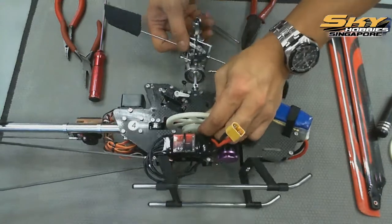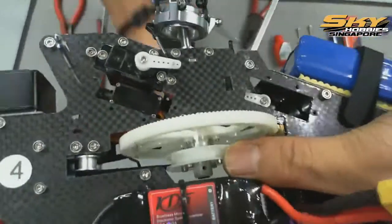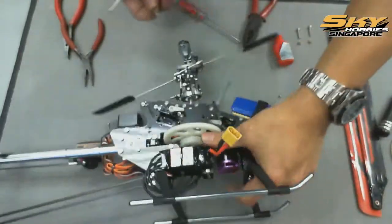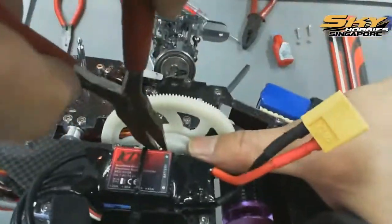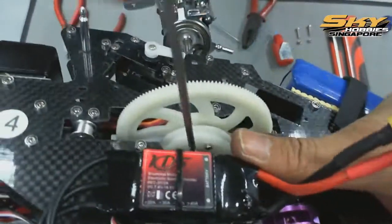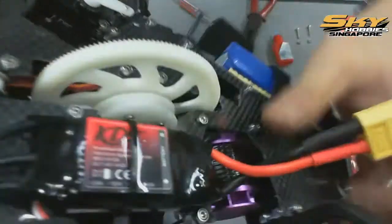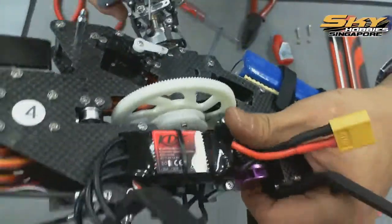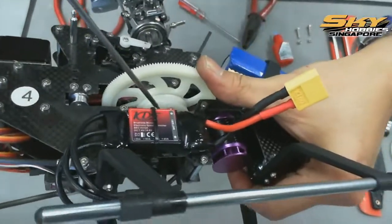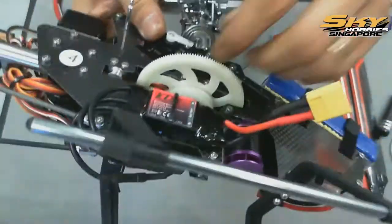And next thing you do is to insert the bolt which you took out earlier. Okay, got it. Managed to get the bolt through the hole, both the main shaft and the one-way bearing shaft. Free turning on the main gear, and when you hold it, it turns free on the other side. That's how you indicate the one-way bearing is working fine with the bolt going right through the aligned hole on the main shaft and the one-way bearing shaft.